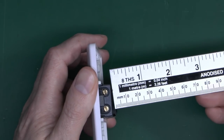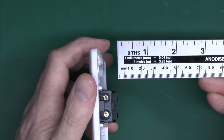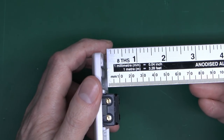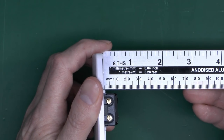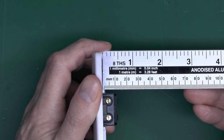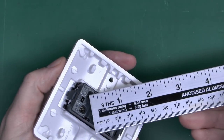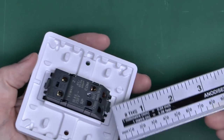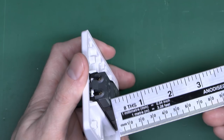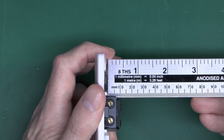The depth on the back of the Logic Plus is around 10mm, so this will fit into a 16mm wall box. 16mm boxes aren't particularly common now — 25mm is certainly a more common choice these days — but if you've got a 16mm then this will definitely fit. The wires come out via terminals here, so they'll come out the back and add a small amount of extra depth, but the terminals are actually recessed anyway, so it's not going to be a problem to fit that.